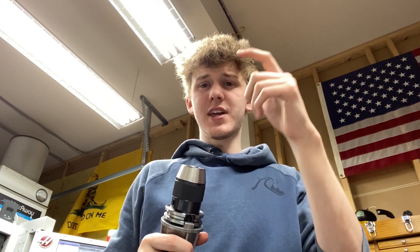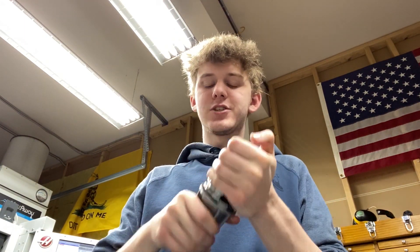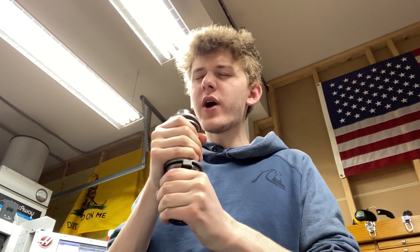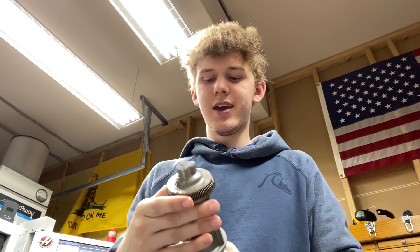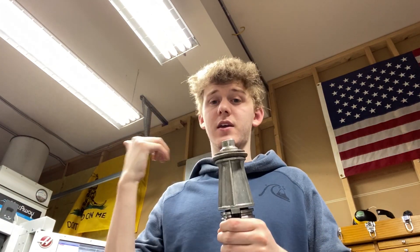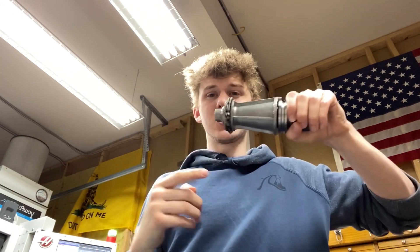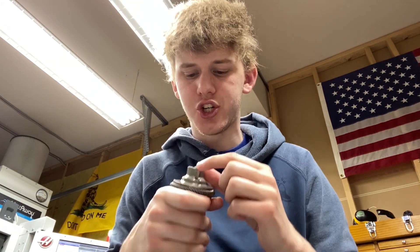The max gauge length on a DM2 is seven inches. I can see from here it was seven and a half. It's funny because I knew I should have checked that and I didn't — so always, always check. When it went to tool change to another tool, the carousel went up and the drill that was sticking out hit part of the inside of the enclosure. It just snapped off and fell down on the chips.